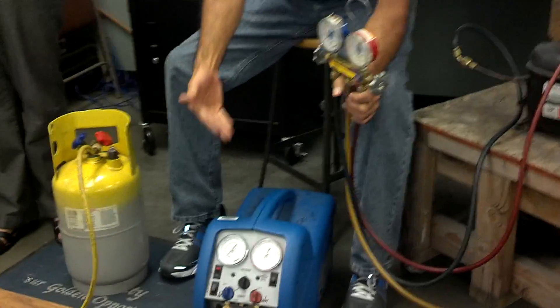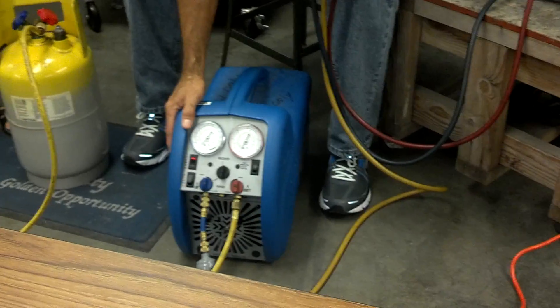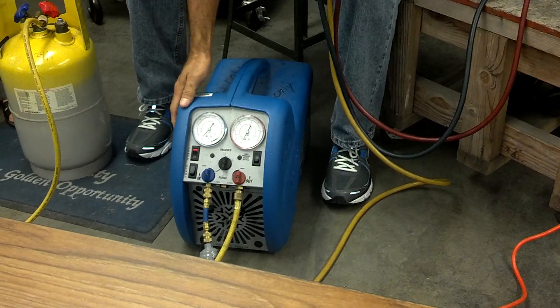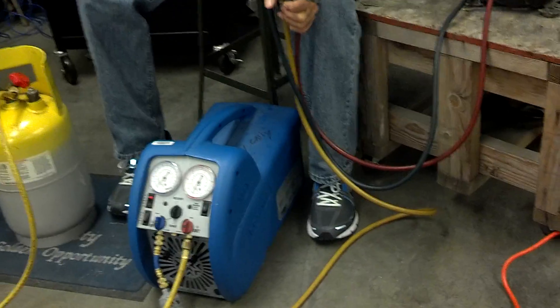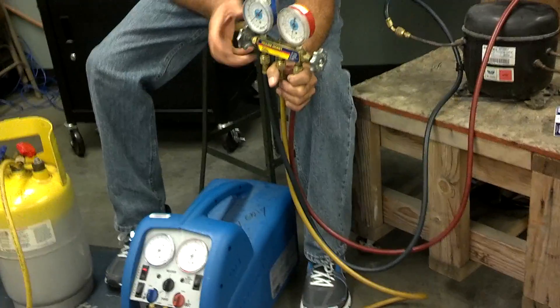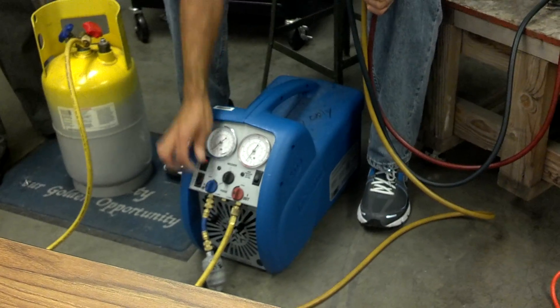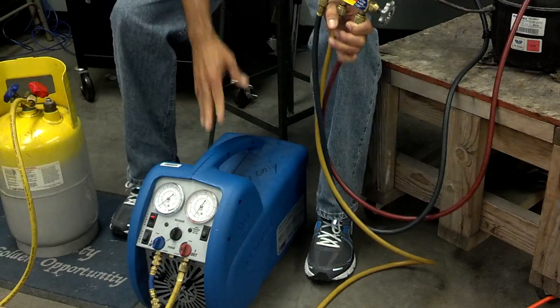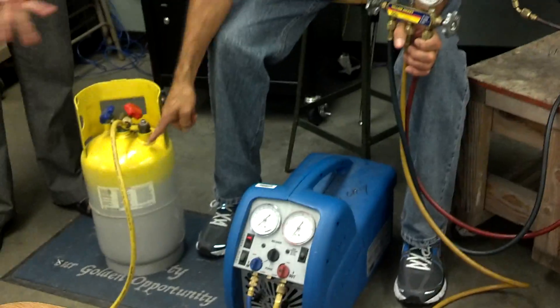Once the fans are working, turn on the compressor. You feel it now — that's the motor, the compressor turning on. Once it's on, slowly open up both valves. Open the gate first — this one up here — then come down to the pump and slowly open this one up. All this is doing is taking everything from the system into your manifold gauges, and from there it goes into your cylinder.